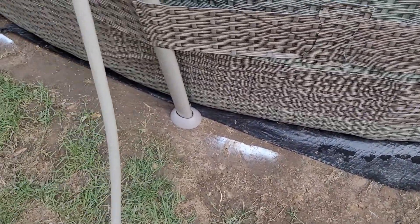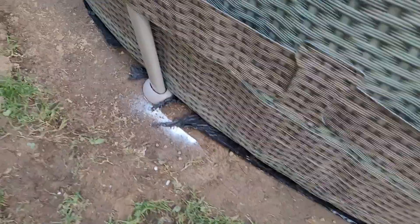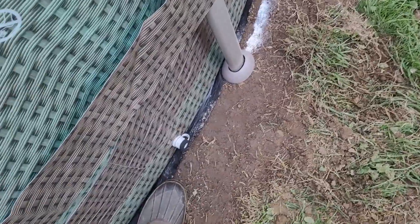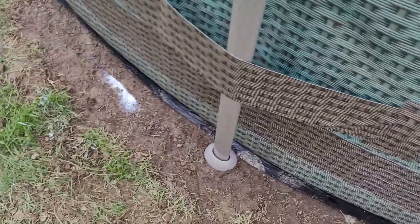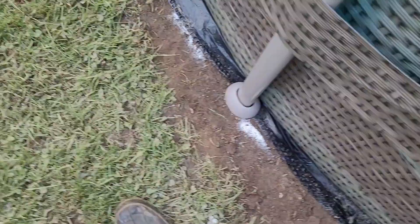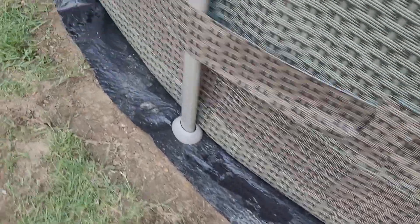I did go around and took a string on that center post that I used for my screed board and went around with paint to mark the perimeter, because I didn't want to take out any more room than I had to. It was nine foot six inches to here, so it gave me a two inch play. You can see we're off a little bit there, so you need to screed it a little bit further than what you might need. You want to give it a little extra room if you have to move something around. These are all where they need to be.